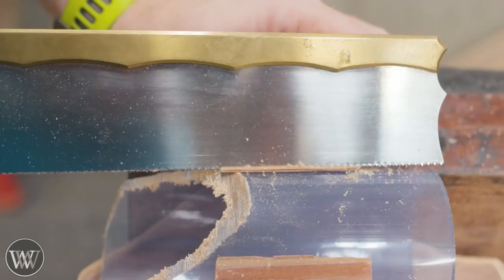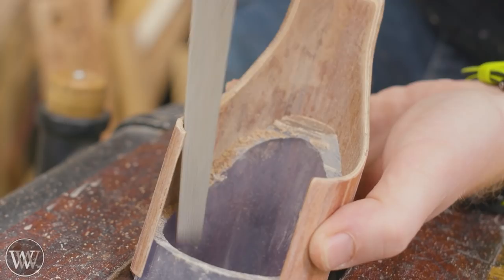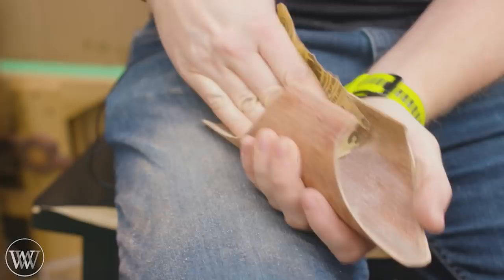The two wings that come out, we need to trim those off. I left those a little bit long so that they would stick out, and then we can come in and smooth them off. And from this point on, it's a little bit of this and a little bit of that. I'm going to do some of the aggressive work with a rasp. I want to actually make the inside here tapered so it accepts the bottle a little bit easier. And the rasp actually works really well to get it roughly to where I want. And then I'll come in with a file and get it a little closer. And then I'm going to come in with sandpaper and get it a little closer. And the final thing that's going to touch this is the sandpaper because I want it to hold to the epoxy.